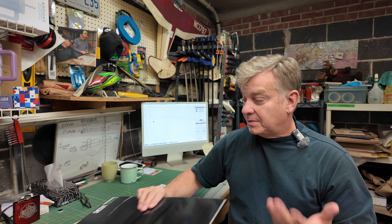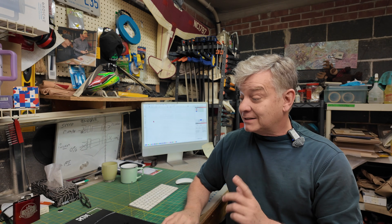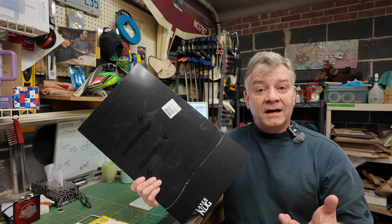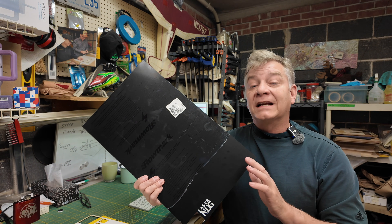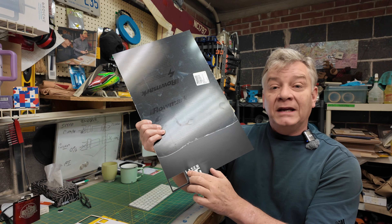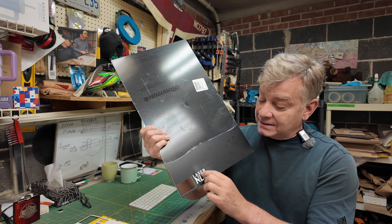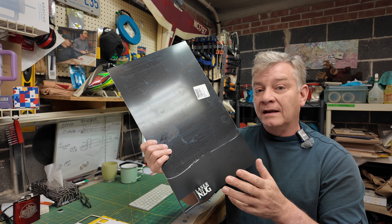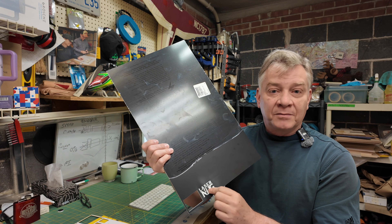This is where you've got a bit of a change in thinking. As I started out with my lasers, I always thought everything had to be done in one pass — and that's just not true, because this is one of those times when you need multiple passes. Or as Robert Kohfeldt has taught us on his YouTube channel called Computer Creations, you sometimes need what he calls a cleanup pass. You've got your main settings that get most of that cap layer off, but when you're done you still see bits of it. So you do a second pass with a different power setting and a different LPI setting, just to catch those little extraneous bits that didn't come out the first time.